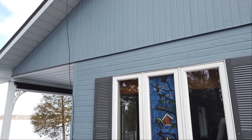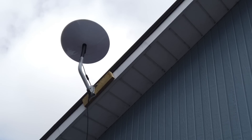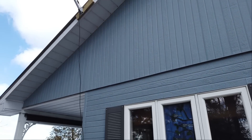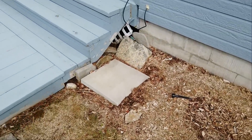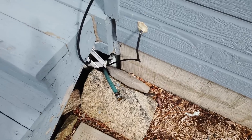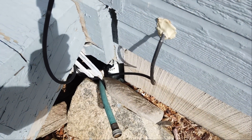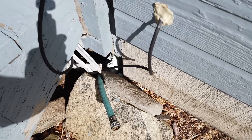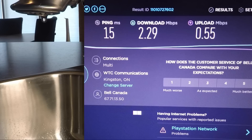The dish is up there — you can see it's mounted using the same technique. I haven't pinned down the cable yet; it's just been too cold and windy. It comes all the way down here, and I drilled a seven-eighths-inch hole — theoretically you can get away with three-quarters, but a little bigger gave me more clearance. I've got some plumber's putty in there until the warmer weather when I can do a proper patch-up job. Make sure you have a drip loop so water doesn't try to get through that hole. Once it was all strung through the basement and connected, a quick reminder: Bell landline gives us 2.3 down and 0.5 up — just a dribble. That's the bogey to aim for.